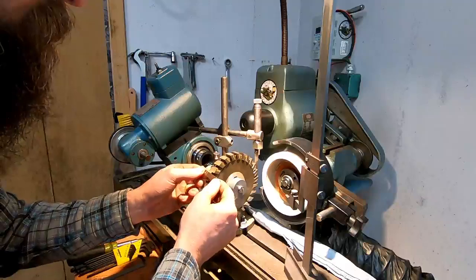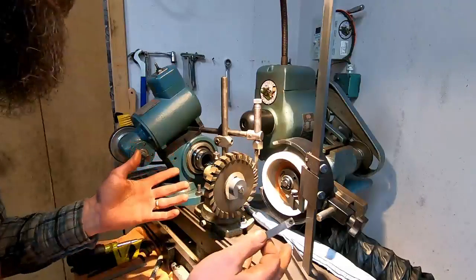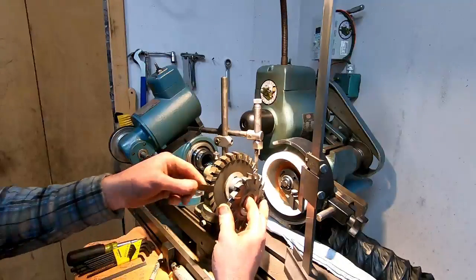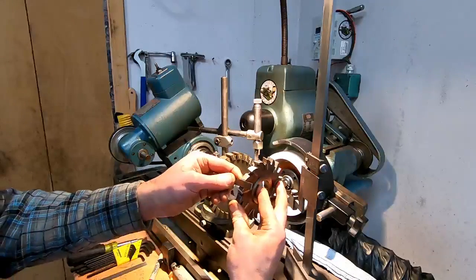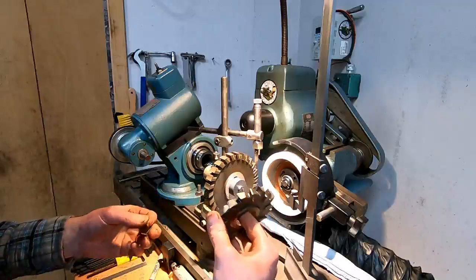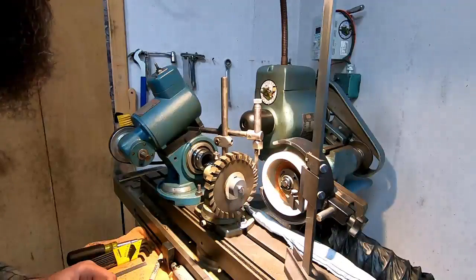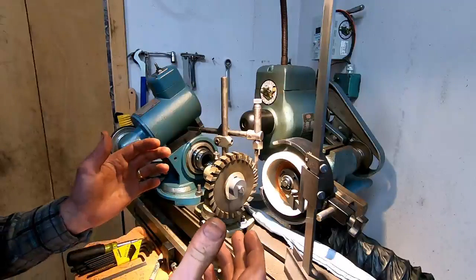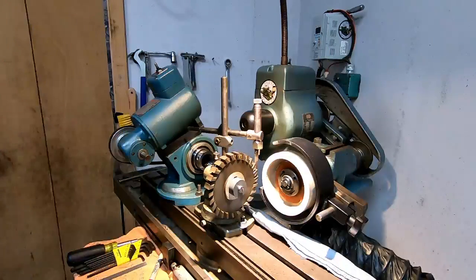And we're grinding a straight-toothed cutter, similar to a saw, which is the easiest, in my opinion, cutter to grind. Like this one here has a helical cutting edge. You can see that cutting lip is not parallel with the bore, so you have to use a certain setup in order to get those teeth sharpened properly. So many ways to get things wrong, and so few ways to get things right. That's my motto as far as cutter grinding. It's tough, but nothing that anybody couldn't do.